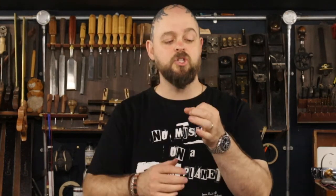Another question, how would you connect them without a joint being noticed on the outside surfaces? It's quite simple, really. You need to just drill a hole halfway through and make sure that the glue in there is strong enough. An alternative is to have a solid rod that has a step in it. So you've got, say, an 8mm section, and then the rod itself is 10mm. Giving you the bottom of the cavity, the sidewalls of the cavity, and actually a little bit around the top of the cavity to glue to, and that would be fine.